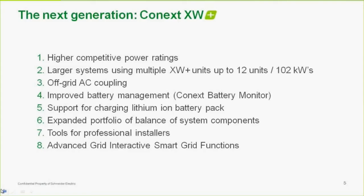One of the things that they have to add to that is what I call a Chernobyl switch. And what that is: if the battery pack exceeds its maximum current, whether it be charging or discharging, it has to have an internal relay to disconnect itself. So internal to these types of batteries is a disconnect relay. So if you exceed the current capacity of the inverter or the battery banks, instead of having them explode, it disconnects them, which is problematic in a battery-based inverter, because if we disconnect the battery, the entire system shuts down, and it's not self-recoverable. You'd have to redo everything, basically.